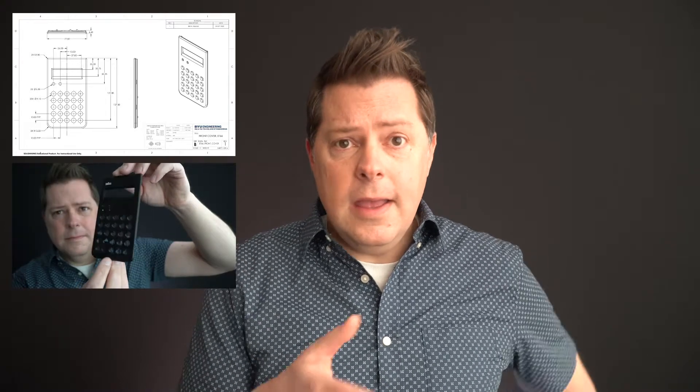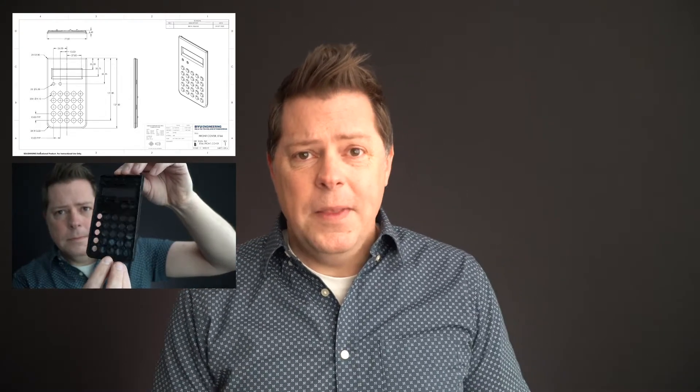As you know from the last video, we start the strategy by breaking down the complex part into simple shapes that can be modeled in the CAD system. When we're creating a CAD model of an existing part, the engineering drawing, or if we have it, the physical part, is where we find the details needed to make that solid CAD model. When creating an original design, we turn to our own hand sketches, simple prototypes, and possibly even competitive parts to make measurements and understand how the complex shape can best be broken into its simple CAD-modelable shapes.